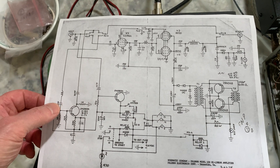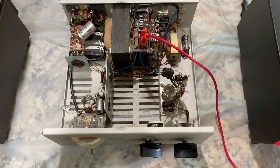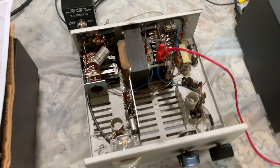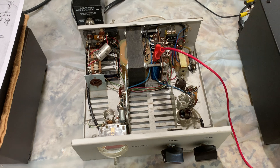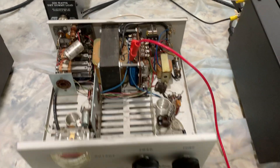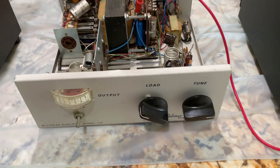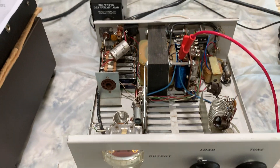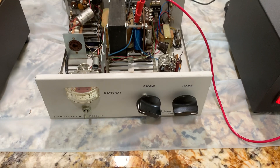That's kind of where I am on this. I'm going to try to get this thing working and use it here at the house as my 10-meter amplifier. With the 6LF6s, it'll probably do a bit more power — maybe 160 watts out. It'll do at least 150, so that'll get my 50 watts up to 150 easily. This is W5HRO and the Palomar 150 mobile amp. By the way, this was made for 26 MHz up to 54 MHz, so you could change the tap on the coil to make it work on 50-some megahertz. That's why there's no input tuning, which I also have to add. 73s, this is W5HRO.